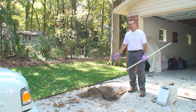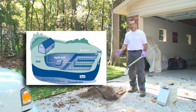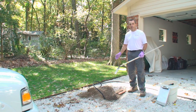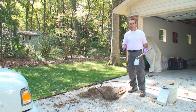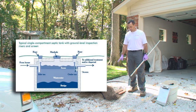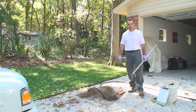The system is usually broken down into three parts: the treatment tank itself, after the treatment tank you have a distribution system of some type, and after the distribution system you have an absorption system. We try to inspect and report on each individual part. So where the tank may be satisfactory, the distribution system may be unsatisfactory or need further testing — those are the type of conclusions we try to come to. On this system the treatment tank is here and we're going to go over to the distribution system that we have opened up and look at that next.